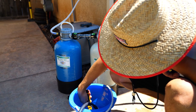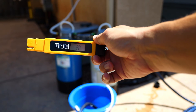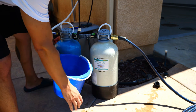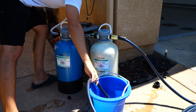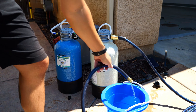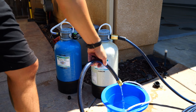This one is reading 20. Let's run another gallon or two and dump this out to see if we can get down to single digits. According to the manufacturer, the optimal flow on this is less than three gallons per minute — that's what they recommend.